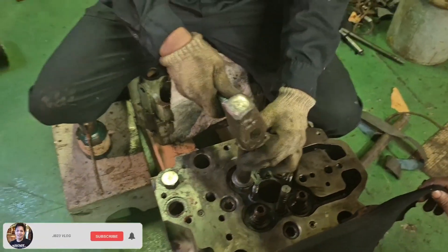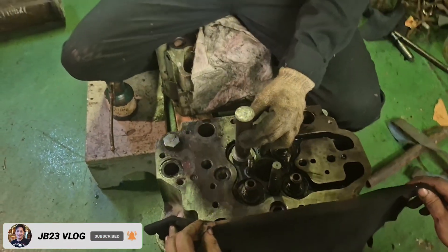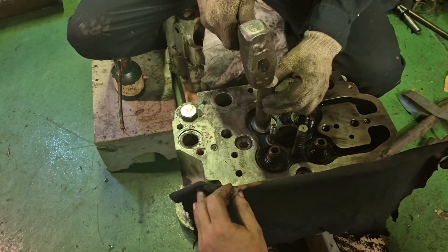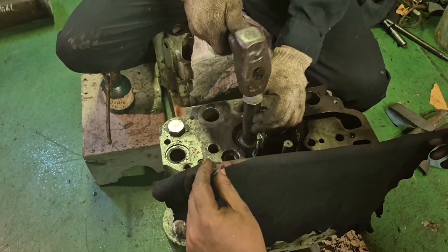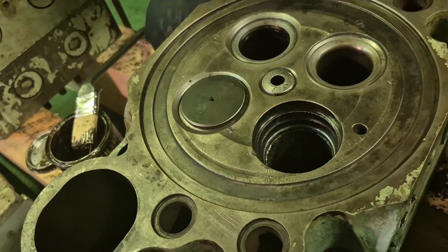As you can see, you have to punch it up to the end point of the valve guide into the cylinder cover. Just hammer it and you can hear the solid sound — that means it is touching into place.